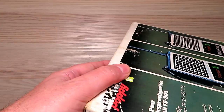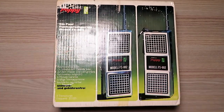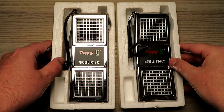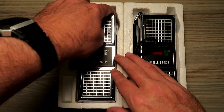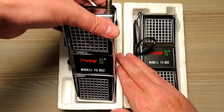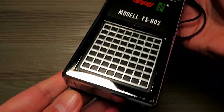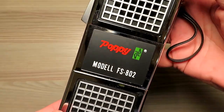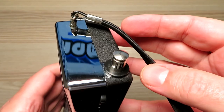It's an 8-transistor radio with an output of 100 milliwatts, a single channel AM only. These were all manufactured on the same frequency — 27.125 MHz — and it used a slightly lower rated crystal because of the 455kHz IF. That's why you'll see when you open it up there are two different crystals in there.